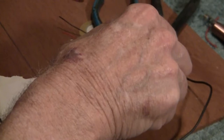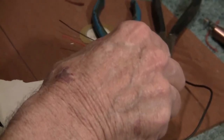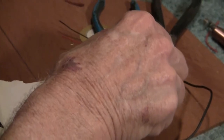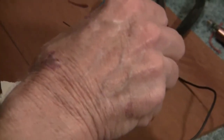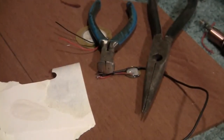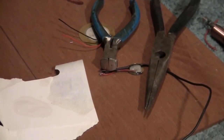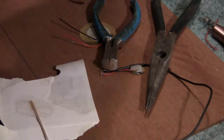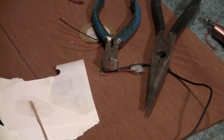And the most critical thing is that the face of the housing has to have a thickness equal to 1/2 of the wavelength of the frequency that the ultrasonic transducer is using. These are used a lot in ultrasonic generation and sensing. They work both ways. So anyway, I'm going to wait 10 minutes.